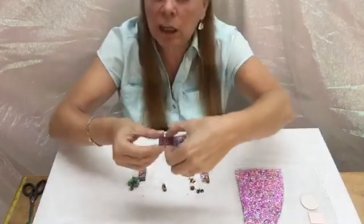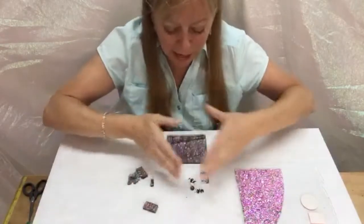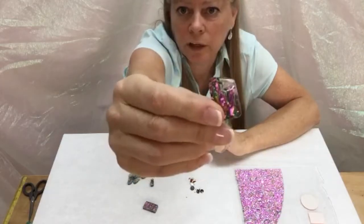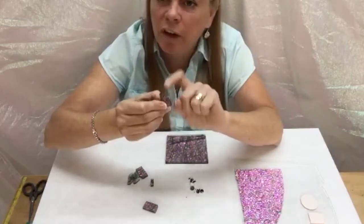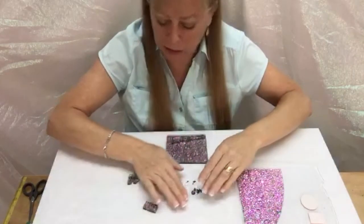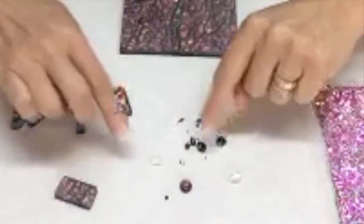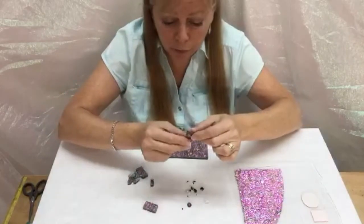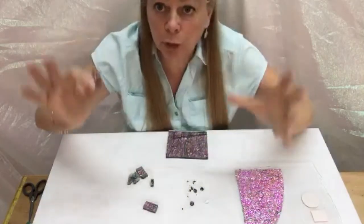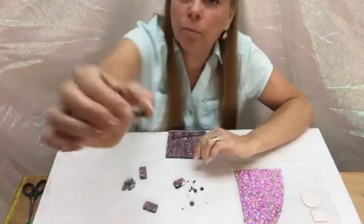What happened was I put it in the kiln looking pretty simple going in, but coming out it was an explosion. This little piece of glass had exploded — can you see where it's clear? That moisture got trapped in there when I went to fire polish it, and it boiled and exploded. All these little bits of clear and dichro and black just exploded. I know it happened before the full fuse because everything finished fusing — so this was on the way up, it started to boil and it exploded. Fortunately it didn't ruin anything else in the kiln. I was very lucky, but it's just something I wanted to point out to you to be very aware of.